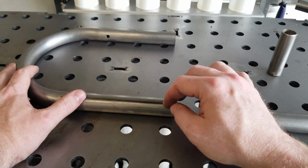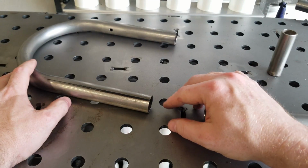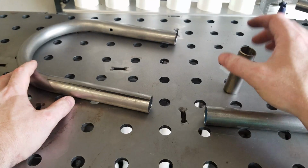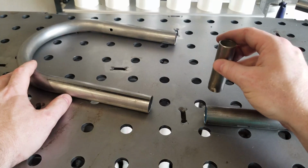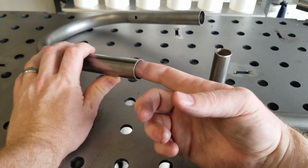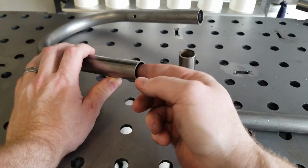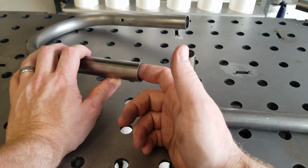Mild steel, ERW. So if you're going to slug, and I believe that is the correct term, two pieces of tubing together with another piece of tubing or with a piece of solid round stock, how do you deal with that little ridge? Well, there's no real easy way to do it. You're gonna have to bust out your grinder, like a pencil grinder or a Dremel or something like that, and whatever the length of this tube is, that's going to be inserted in here, and you're going to have to grind that weld off. There's just no two ways about it, unfortunately.